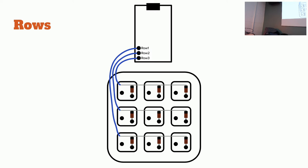I ran my things to the wrong side, so they're on the right side instead of the left side. Can that be reprogrammed? Or should I wire them to the other side? So, fun fact, you do not have to use the end of the row to connect it. Because these are in parallel, you can attach your wire anywhere along that wire. So even if you ran those to the corner here, you could snip it off, and you could attach here. You could still reuse those. It's up to you.